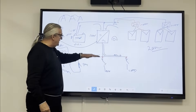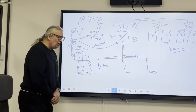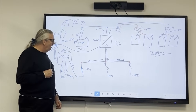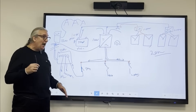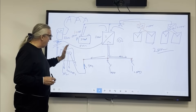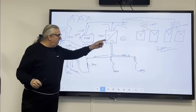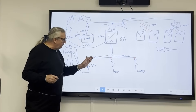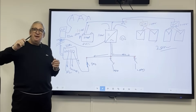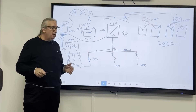So you have a common AC bus. One of the things people ask about is the changeover time — well, it hasn't got a changeover relay. It's a common bus; there's no changeover. We've got a grid relay that can open — called islanding — which has to open if we lose power. We detect there's no AC coming in and open that relay in a fraction of a second. But once that relay opens, the inverter is still running — it's supplying the auxiliary or the load. It's continuing. That's a hybrid inverter. Whereas a conventional string inverter, once the grid's gone, the whole thing shuts down.